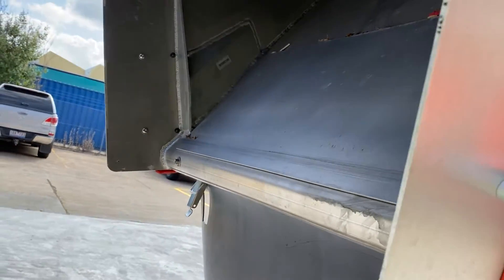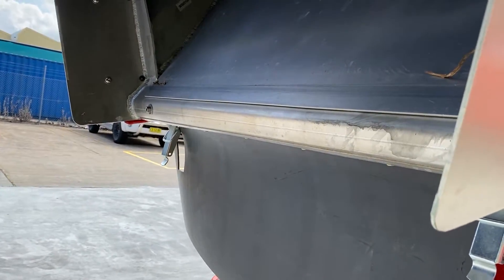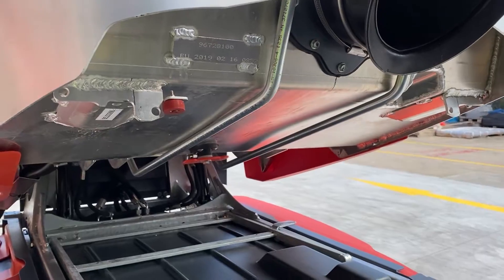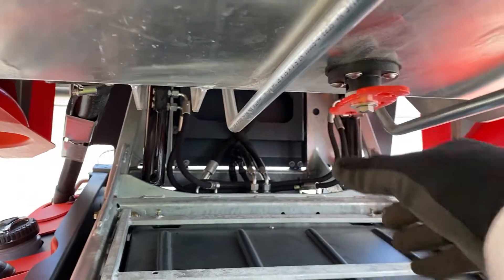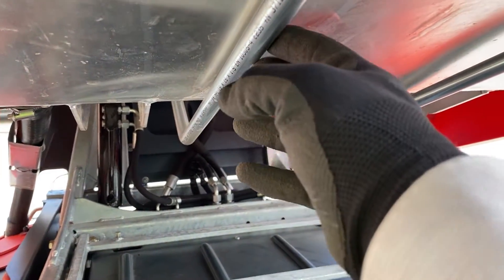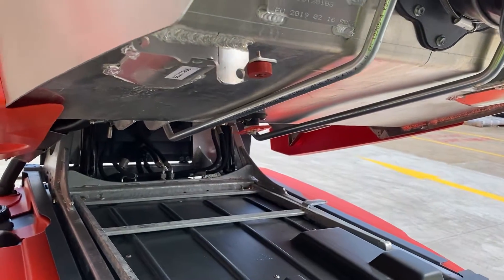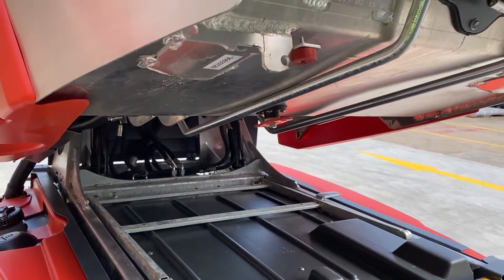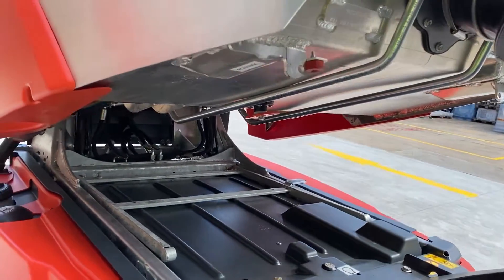The dump height is about 1.5 meters, so enough to get into most skips. I'm now going to lock the belly pan. You'll notice we make extensive use of solid piping where possible, as opposed to flexible hose, so that maintenance on the machine is minimized as much as possible.